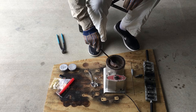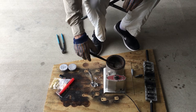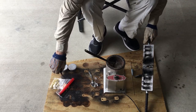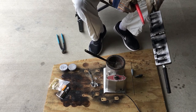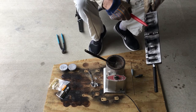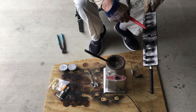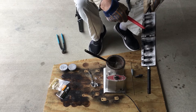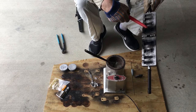One thing I like to do with my ladle is keep it in the lead and get that ladle good and hot. The other thing I did before I started was I took my candle, lit it, held it sideways, and put this mold upside down. I got it to the point where it was burning so much wax it was causing smoke, and I made sure both sides of the mold are all blackened up.